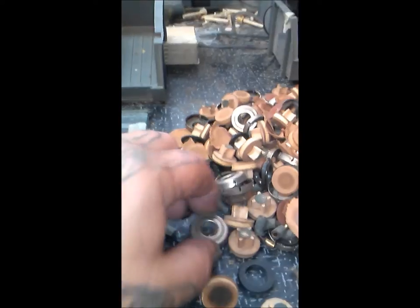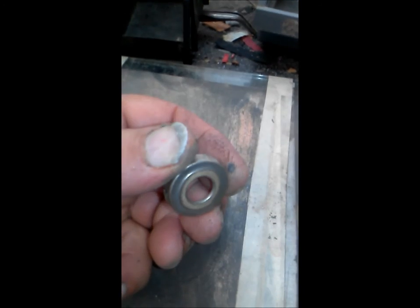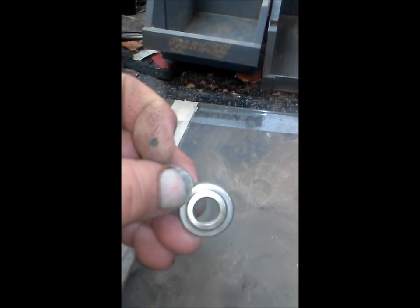As for the top seats, you need to wash them first in methanol to clean them up. Take one and look — it's not flat. So we do the circular motion again, look again — it's flat. Come over to the 400 grit, give it a good pressing and rubbing, and there you go: nice and shiny and smooth. That's how it's done. Do that with all of them and you will have a perfect seal with your valves when you're done. Thank you for watching — this is how you rebuild apico valve blocks.